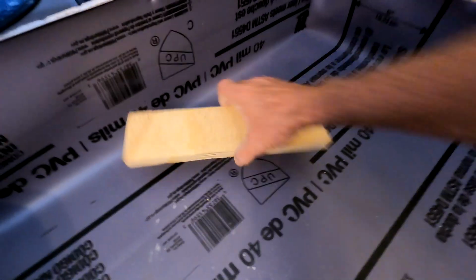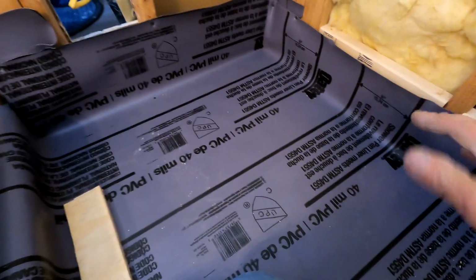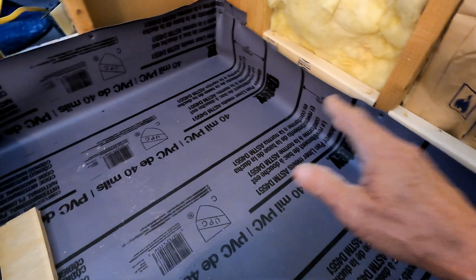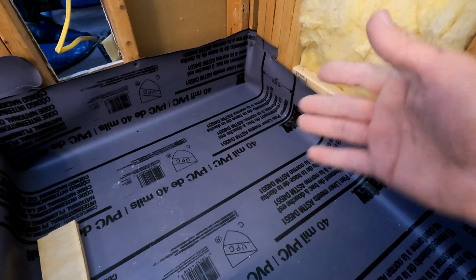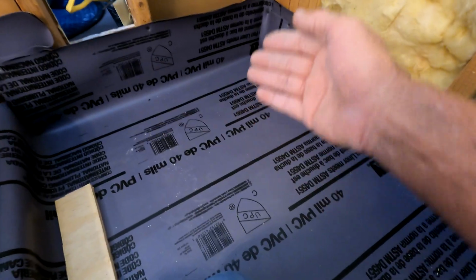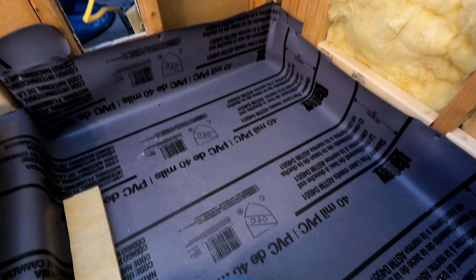So imagine this is a mortar, and you're just putting mortar at the perimeter all the way around. You're putting a level on it constantly and packing it down until you have all four sides the exact same height and they're all level. Now going forward, you just throw in the rest of your mortar and follow off of this screed all the way down to your drain, and now your slope is perfect. That's called a perimeter screed. I don't do that. I've done it a couple of times. I don't find it easier, I don't find it faster, but you might.